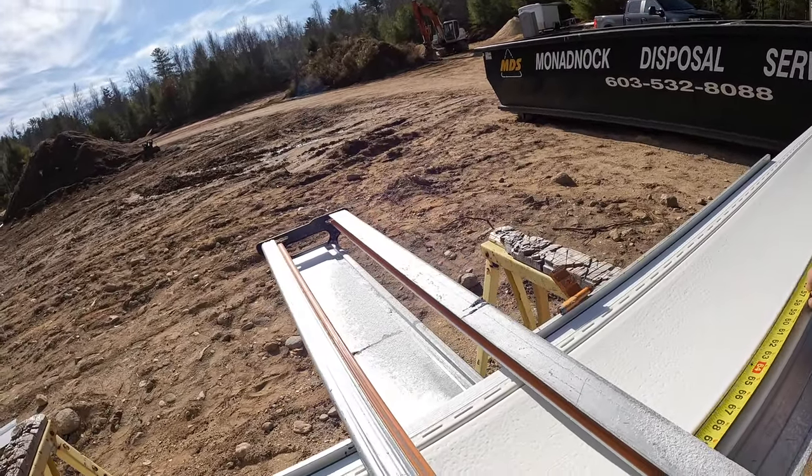And very carefully unclip it. There we go. Now I don't want to put my crimp too close to that line, otherwise I won't get that little tab into the undersill. Now what this does is it gives you a kind of a positive lock on the siding, so the siding can't back out of the corner.